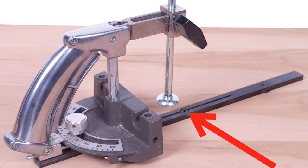A couple of weeks ago, I received two questions from people who were having the same issue — their miter gauge was locked in their miter slot. If you don't know what's happening here, we're talking about the Shopsmith miter gauge, which has a slot cut in the bar. In the middle of that slot there's a tapered set screw, and we can lock that in place in a number of applications.